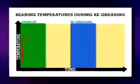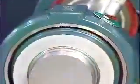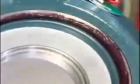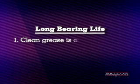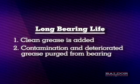There will be a temperature rise which will be indicated by the aid of a thermocouple inserted in the bearing housing. As the excess grease and remaining grease is channeled and distributed throughout the bearing, the temperature will decrease and stabilize. We have accomplished two very important requirements to achieving long bearing life. First, we've introduced clean grease to the internal contacting surfaces of the bearing, which helps to prevent bearing wear. Second, we've purged contaminated and deteriorated grease from the bearing.